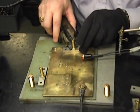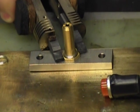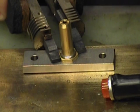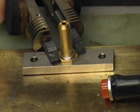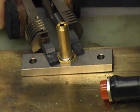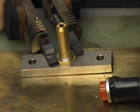We place this on here and we've got a run light so that you can see the actual dwell time it's going to take to flow the solder. I'll go ahead and start the heating process and then lower this bellows onto the shank, and you'll see it relieve itself down into the liquid solder as that melts.